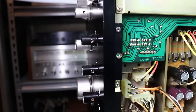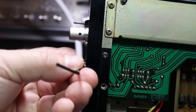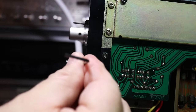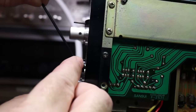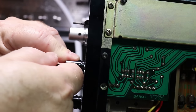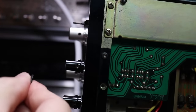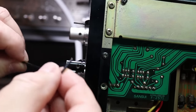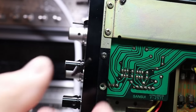While I'm mentioning hex wrench sets, let me show you a technique for getting them loose, because sometimes these hex screws can be difficult. The best way is with the unit on its side. First try it on the long side. If you're having to bend the tool like crazy, turn it around to the short side — that gives you a lot more leverage and a lot less chance of stripping that screw. Also, buy a good hex wrench set to avoid stripping.